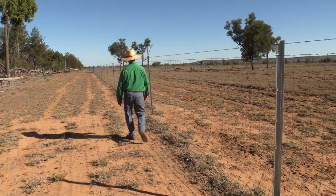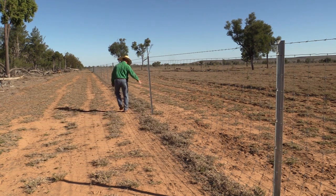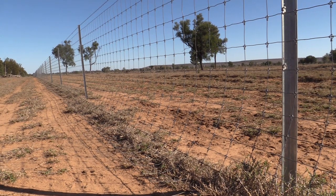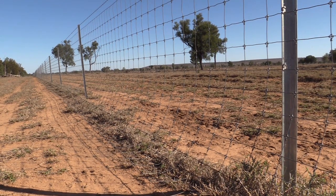The number one tip for fencing is the preparation of the fence line. What we'd like to see people do is have the fence line sitting on some high ground so that you've got a natural camber to the outside, which allows you to drain the water at the bottom of that drain. It's terribly important that people don't rush in and flat grade or go in reverse — actually have a camber and sit the fence on top of it, because it makes a lot of difference in 10 or 15 years time when you get erosion from heavy rainfall events.